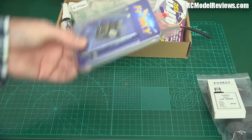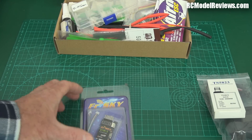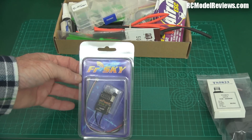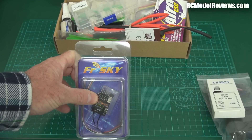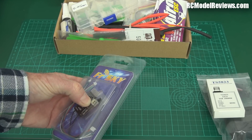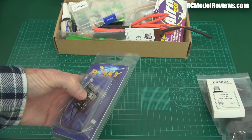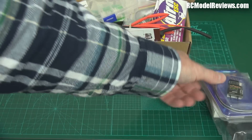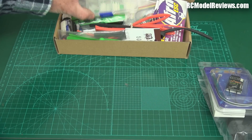You're going to need a receiver — depends on the radio gear you're using. If you're using FrSky, then the D4R2 is just the best receiver for mini quads. It's small, it's light, it does CPPM which means you don't need a whole bunch of wires hanging around, and it has telemetry on board. So if you've got a FrSky Taranis or a telemetry-enabled FrSky system, this is the receiver you want — another $22 or $23. Haven't reached $100 yet.